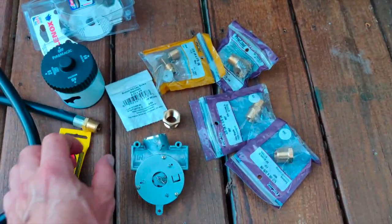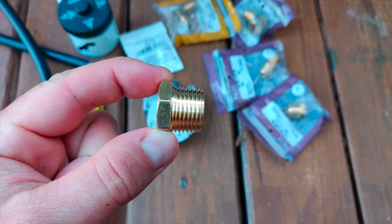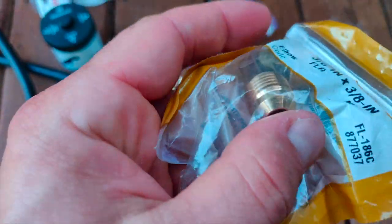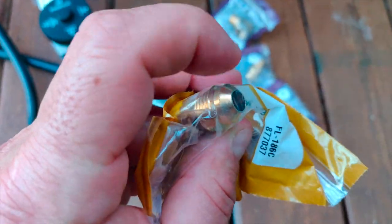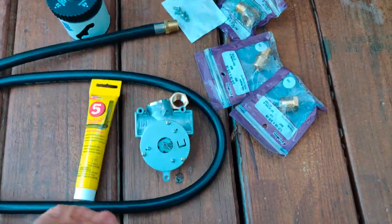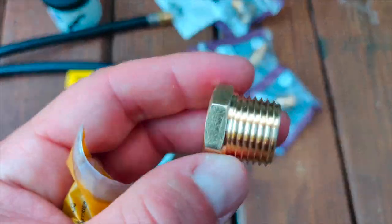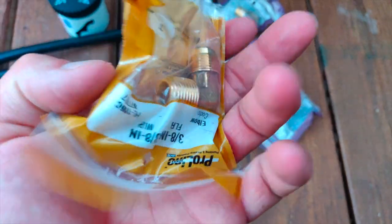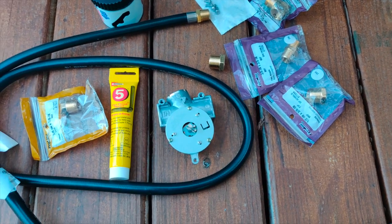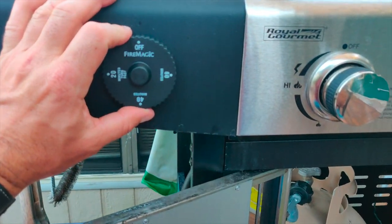of fluids and gases. Now, a quick note on this, I'm only going to be using it on the pipe threads, not the compression threads. These should seal by this taper fitting inside of this taper and then being tightened down, and shouldn't need the pipe thread sealant, whereas these other ones will need it, just helps lubricate and seal it. But if you use it on the compression fittings, I've read that it might prevent a positive seal and could cause it to leak.